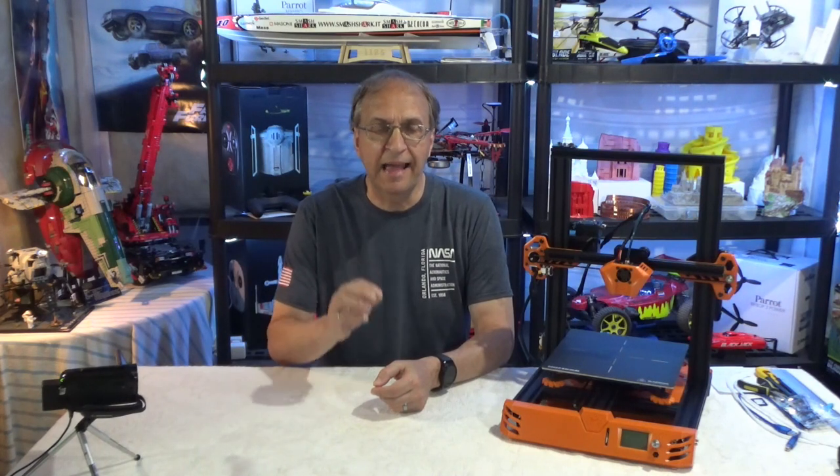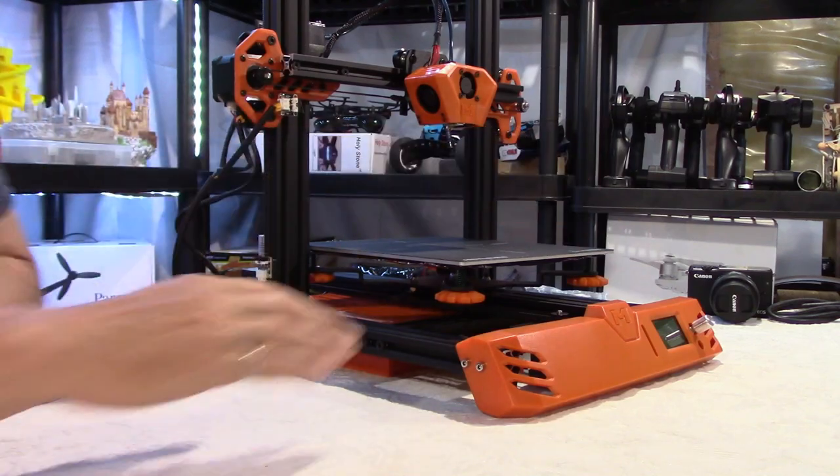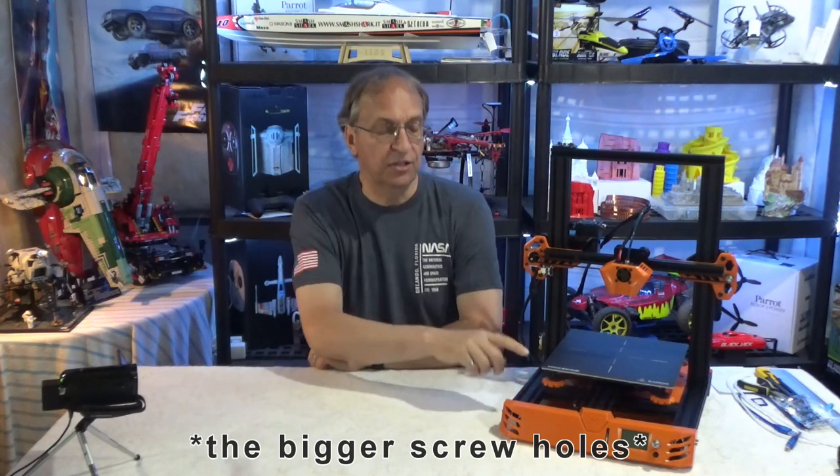Just a quick note: at the beginning of the video I made a mistake. I was focused on the camera angle, but when you install the y-axis rail onto the frame, just be careful that you have the big holes at the bottom. I kind of missed that at the beginning but I did correct myself later on in the video, so I thought I would mention that in case some of you notice the screws at the top of the frame.